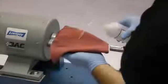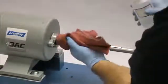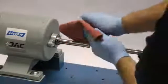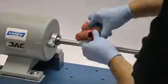Finally, using a cloth and cleaning solvent, we need to ensure the surface of the shaft and the keyway are clean and free of dirt. The hub should also be cleaned to remove any coatings used to protect them during shipping.